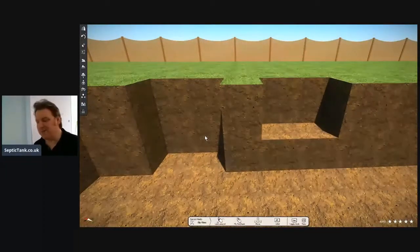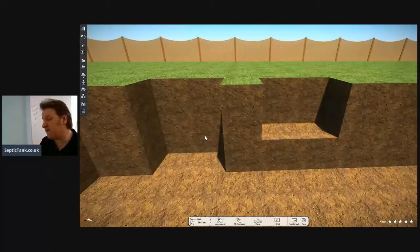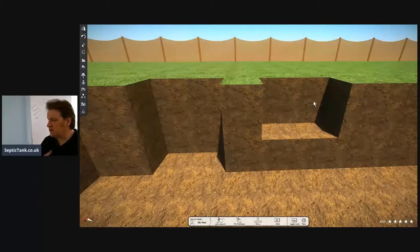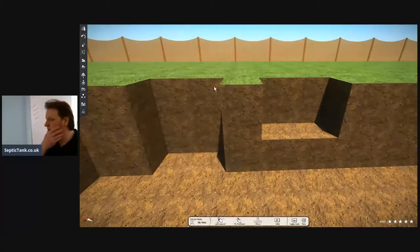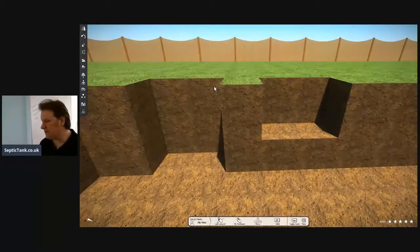With a low-profile tank, you can use a small digger such as a 1.5-ton, 3-ton, or 5-ton digger for the bullet-shaped septic tanks. For the hole for the onion tank, you're going to need 5-ton plus — typically most people have to use a JCB. So you're looking at twice, if not three times the higher cost for putting an onion tank in, just for digging the hole before you do anything else.